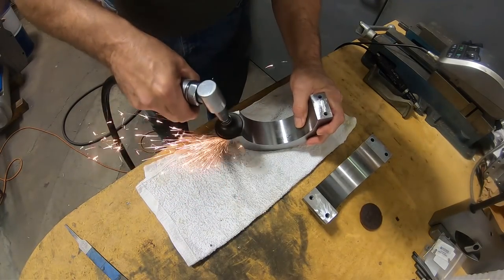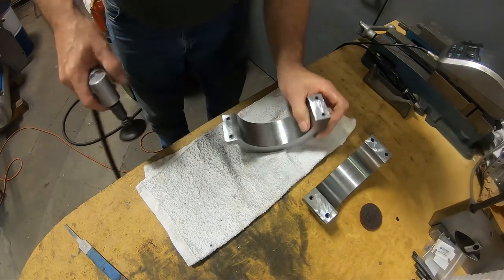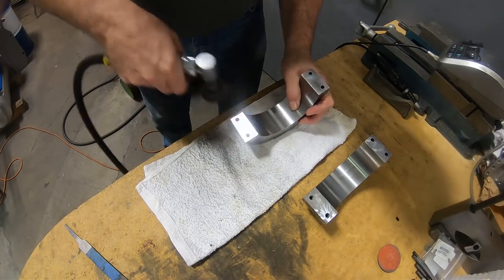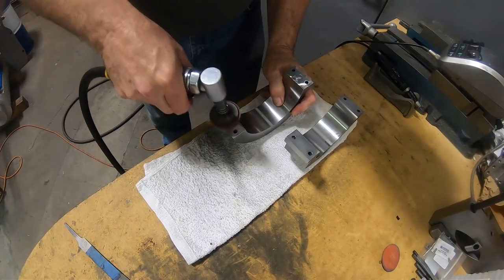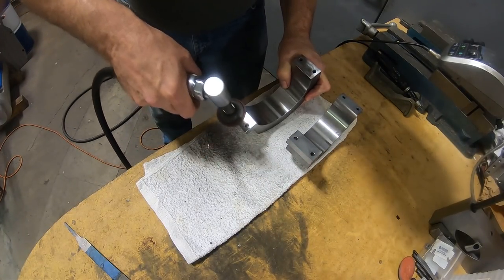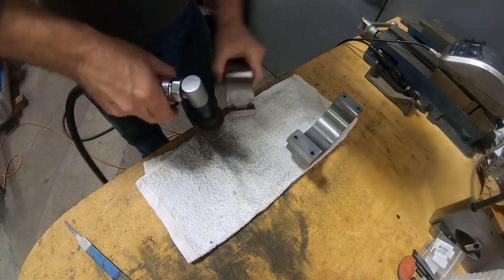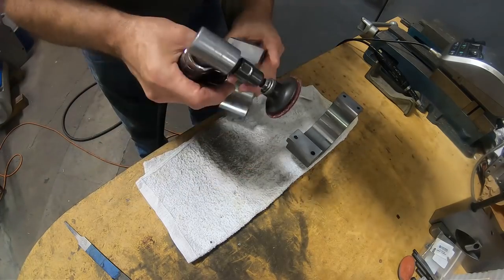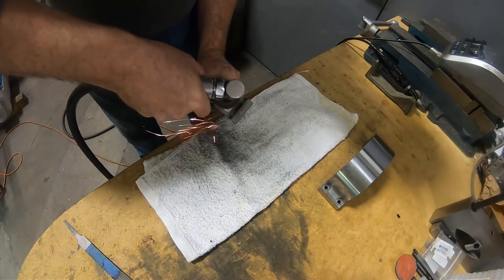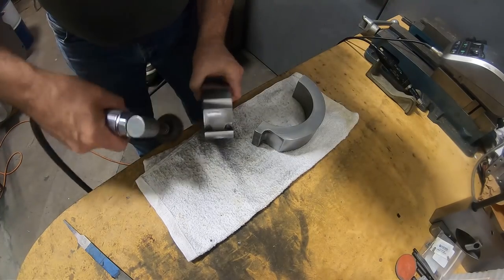The machine can't really move fast enough because it can't accelerate, decelerate, and accelerate back and forth when it's doing that shaping thing to get a high enough surface footage. It would probably work better in stuff like stainless steel or aluminum. In this steel, it just can't get moving fast enough. I had programmed about 500 inches a minute on the cycle, but it never got up to that. It only got to about 350 according to the display on the control.